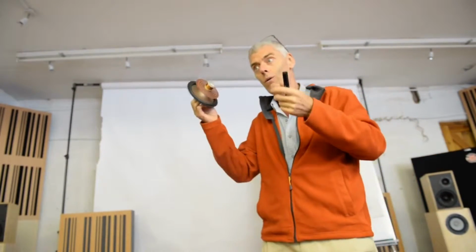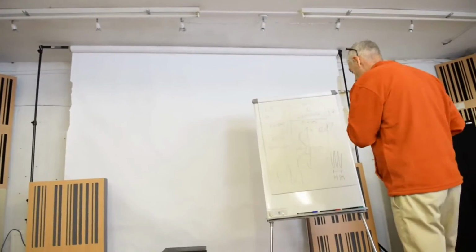When we're looking at the physical world of getting things to move, whether it's a car, a plane, or a speaker, we're always having to try to extend the mechanical design, and we're always caught between a rock and a hard place. On the one hand, we want to get performance, whether it's sound performance or speed or whatever it is. And usually, by and large, the general rule, note the word general, let's say guide, is if you want something to stop, go forwards, turn, or in the case of a speaker, go backwards and forwards, then the lighter it is, the better it will perform that task. So, a traditional full range driver looks like this.